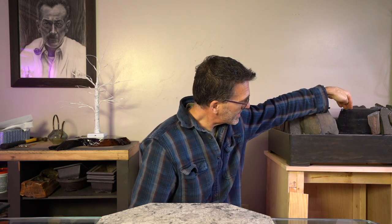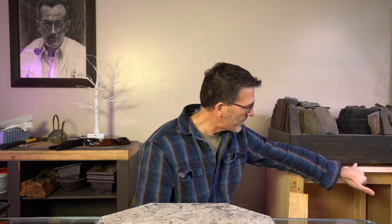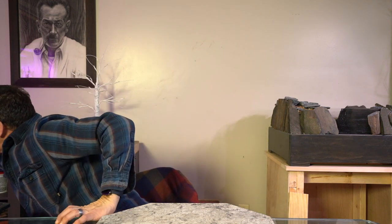So we had to go back to the drawing board. I believe the leak is somewhere where the crease from the plexiglass to the pond liner is — I think that's where a little bit of the leak is happening. I've done another test since the last show, only putting water above this crease but not the back crease, and only a few drips happen right here — just a drip every few minutes. So slow. Where is it coming from? Driving me insane.